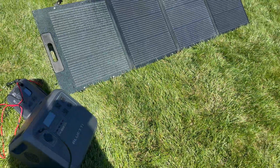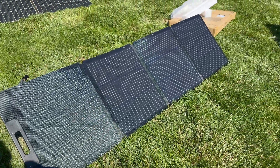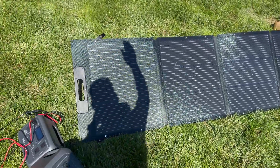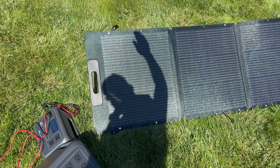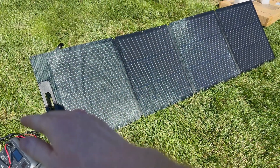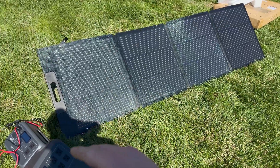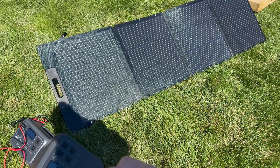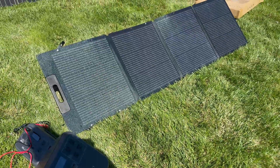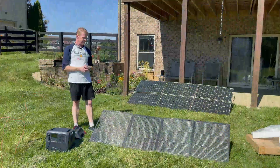Now let me take all the shading away and see what the AC-180 does. The screen just timed out — we're back to 150-something. So partial shading: not so bad, even if you've got a whole panel shaded. 125 watts. What if I just do a corner? 130-something. If I back off a little further, just the edge is now shaded: 151. Now it's all in the sun: 155. Just so you know what to expect. Thanks for watching.